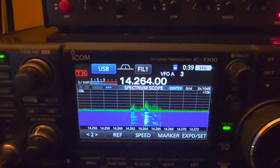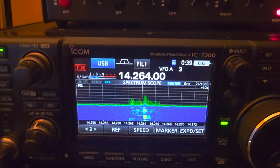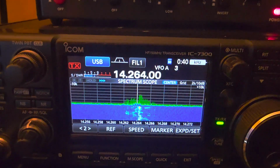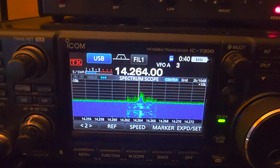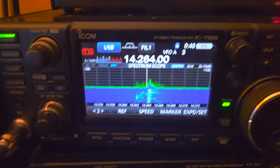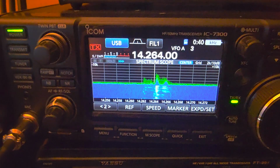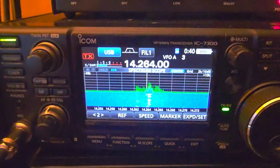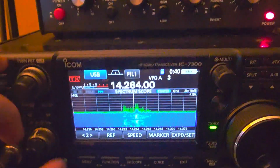The main thing is you need to have an antenna that will pick up noise. Right now I'm running a balanced line fed 160 meter size dipole, and I'm tuned up on 20. Out in the yard, I have a cheap Chinese vertical, a 16-foot telescopic whip with about 10 radials sitting right on the ground. It is picking up the noise pretty good, as well as the main antenna. I've got another antenna, an 80 meter size dipole, that does not pick up the noise hardly at all for some reason. It's at about 40 feet, whereas the main antenna's feed point is at 80, and it's an inverted V. So, anyway, here we go.